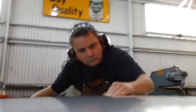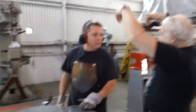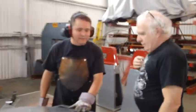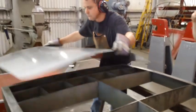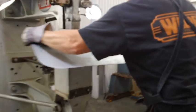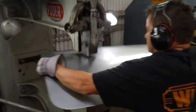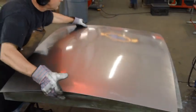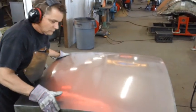Look under here again and you see the light lines — you can see it on the left of the video. So he's checking underneath the buck and he'll check on top and come to some decisions about where to strike next. That's Ben Van Berlo discussing various ways of supporting a panel if you're a one-man operation. It's hard to do a big panel — most people will say the average guy shouldn't do a panel that's over three by three feet, and you're right at the limit here, probably a little over.